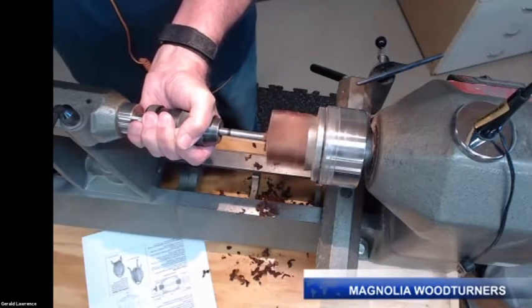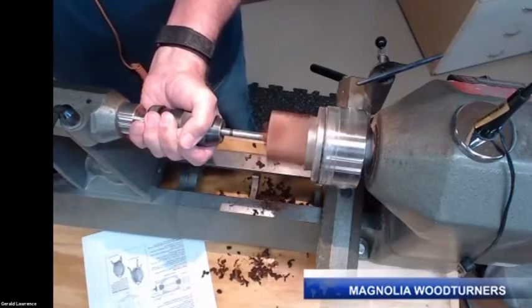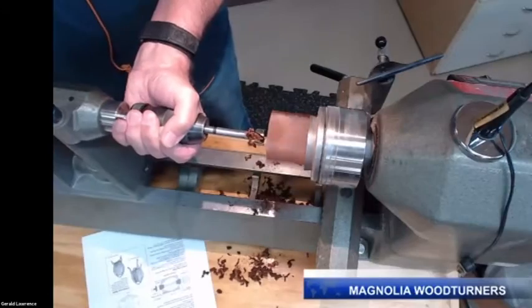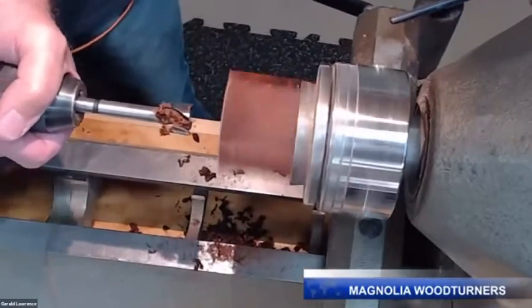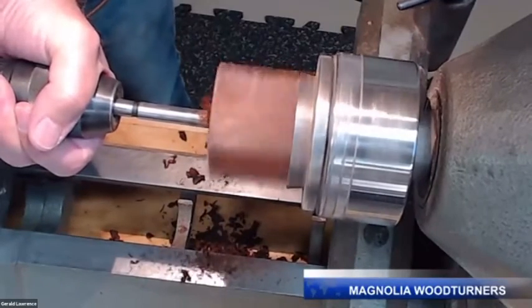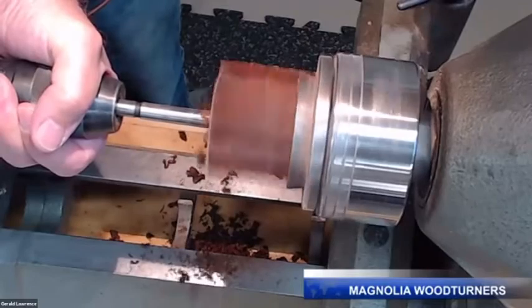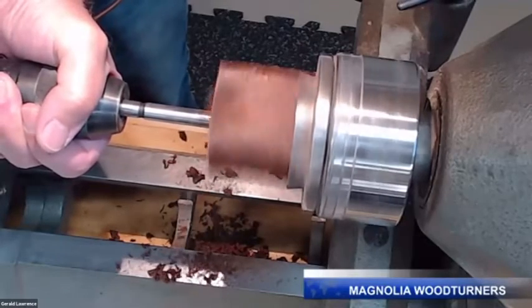You see, this one's actually smoking a little bit. It's some pretty hard wood. This is a type of rosewood. How fast do you drill? 500 RPM. I think we all have a tendency to drill too fast because you're smoking there. Just a little bit, yeah.